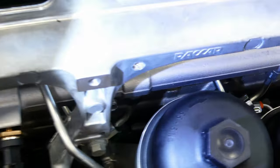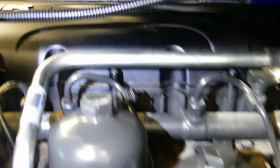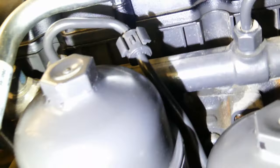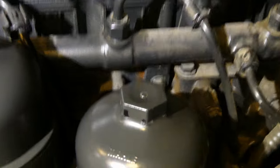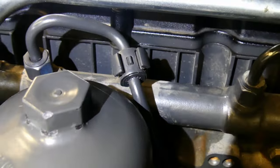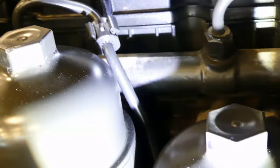This is an MX-13 engine and the fuel filters are pretty clear of the common rail and high pressure lines. The MX-11 has the filters and the high pressure lines very close to each other, so be careful when removing and reinstalling the main filter cap. Once in a while we find that the lines bind with the cap when reinstalling, and since the cap is made of composite material the threads can strip out. Just something to watch out for so you don't run into unnecessary trouble.